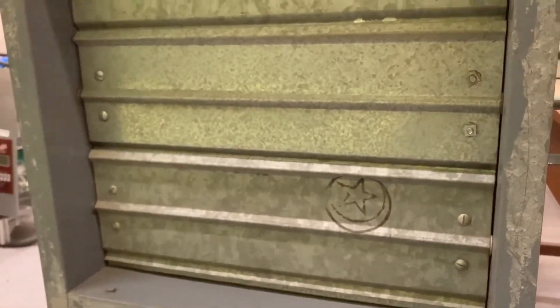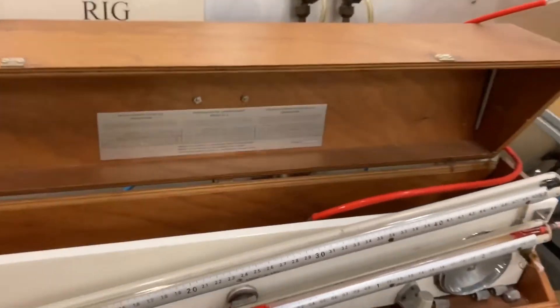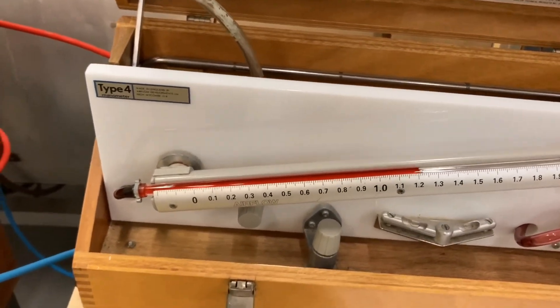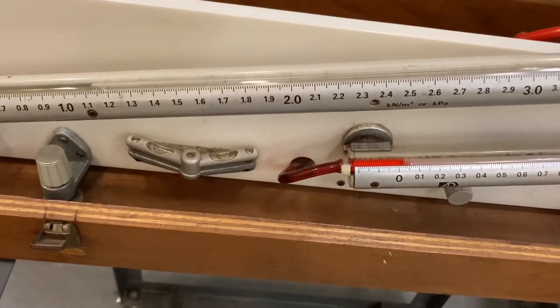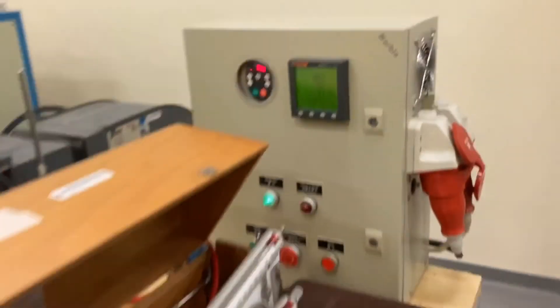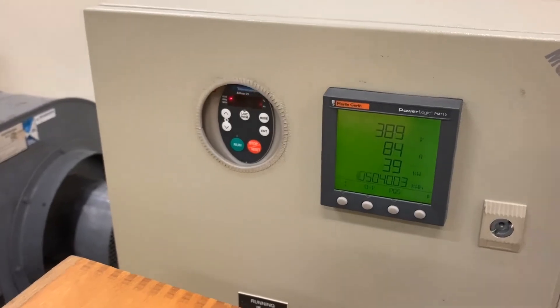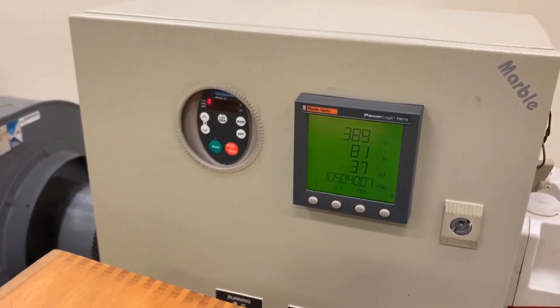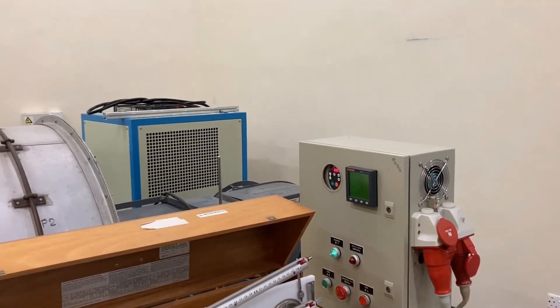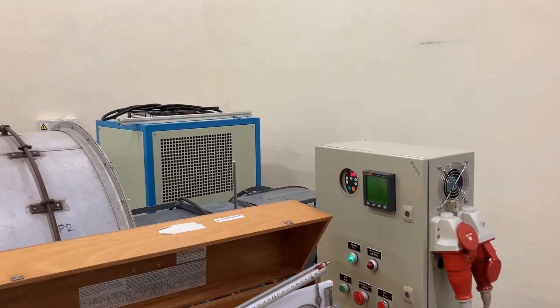We shall then repeat these three steps for all eight other positions until we get to the fully closed mark, which is 10. We take the reading for that — the first reading is 1.2, and the second one around 0.03. We will take the electrical power in kilowatts as well. This brings us to the end of our experiment. The rest we shall do some calculation in Excel.